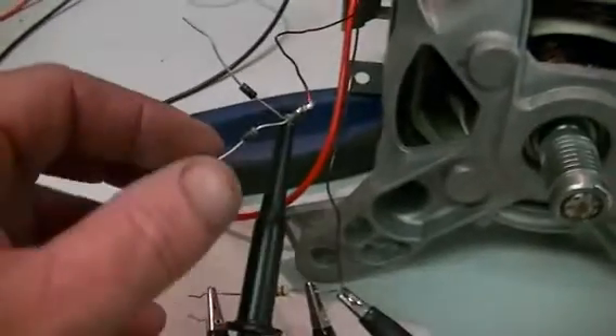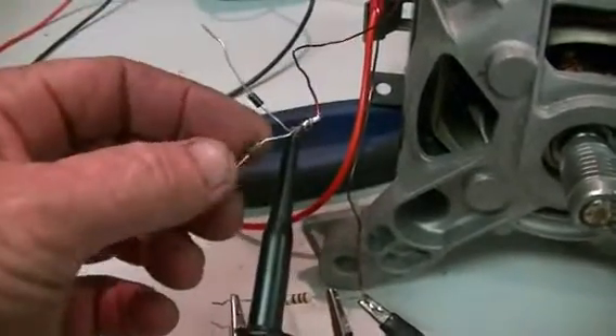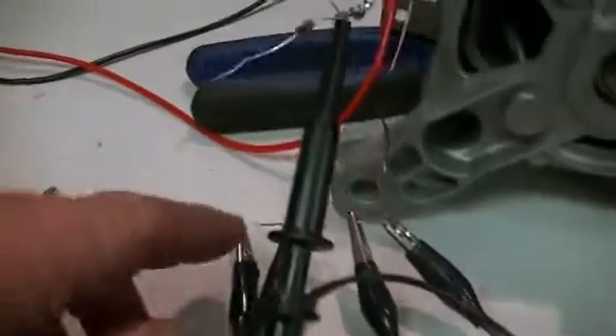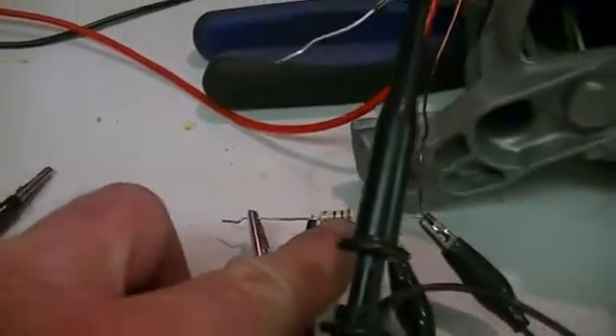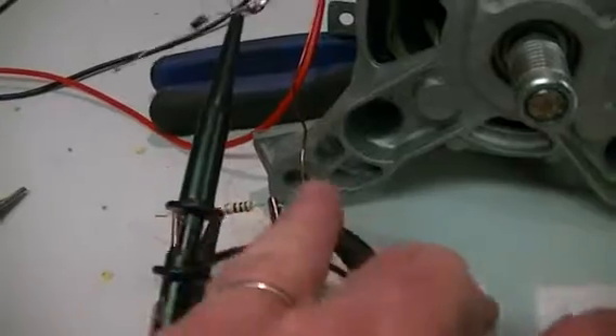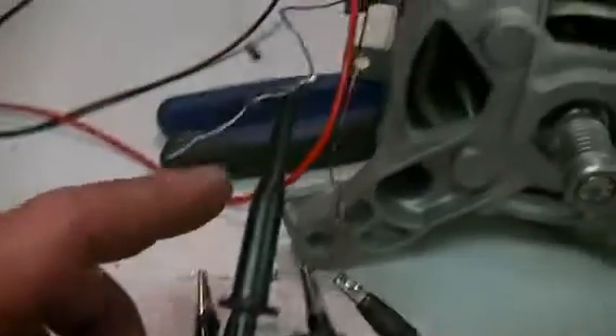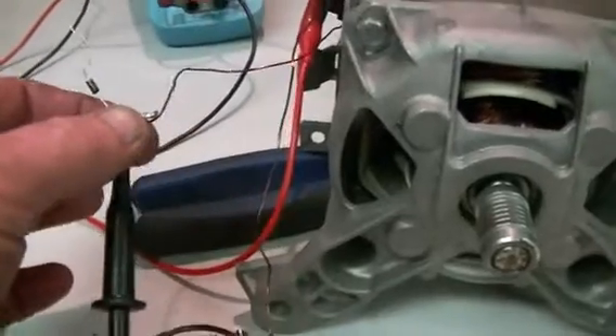It is quite a significant offset on the waveform — it's not an even waveform. It's high voltage on one side and low voltage on the other. I have a 10 ohm resistor down here. Both the grounds are on one side of the coil on the scope; the blue channel is across the resistor, and the yellow channel is across the coil itself.